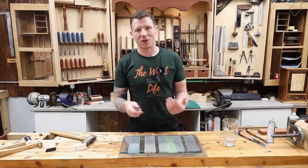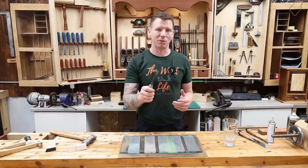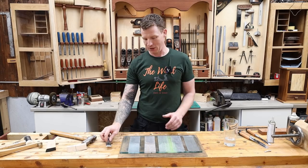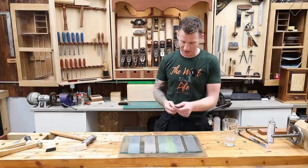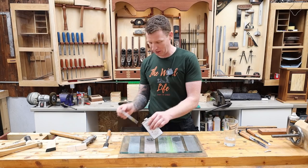The processes for the blade are very similar to western chisels. First thing is to flatten the back. It's not ideal to sharpen these on diamond plates — the softer metal can gum up the grit. These are normally sharpened on water stones, but I use the scary sharp sharpening system: a piece of float glass with 3M micro-finishing film. It's super flat and you get a really polished edge. I apply some honing fluid and work down through the grits.